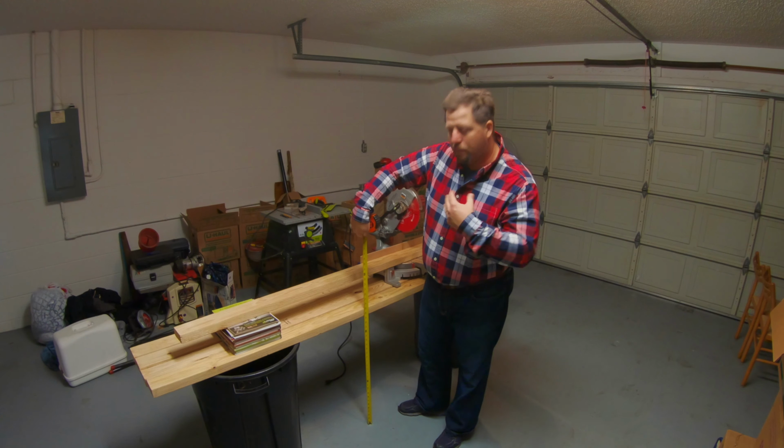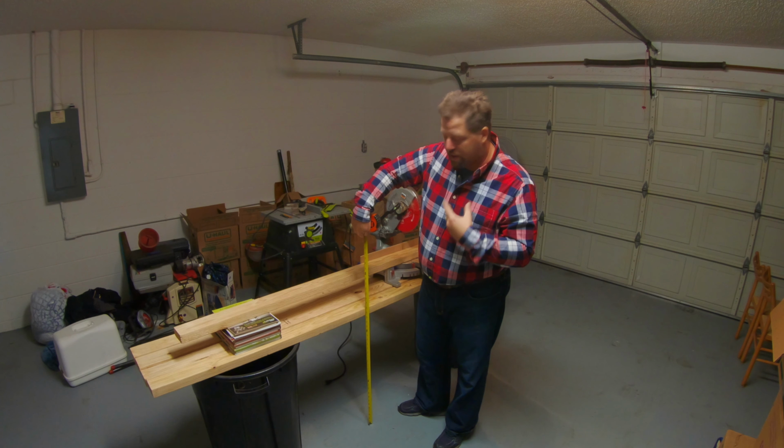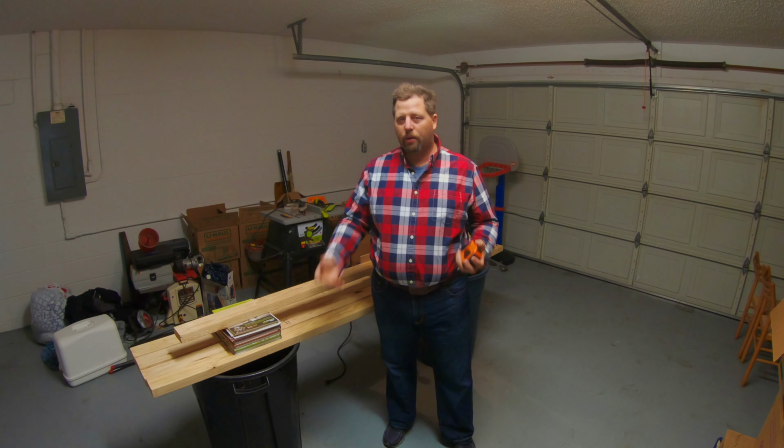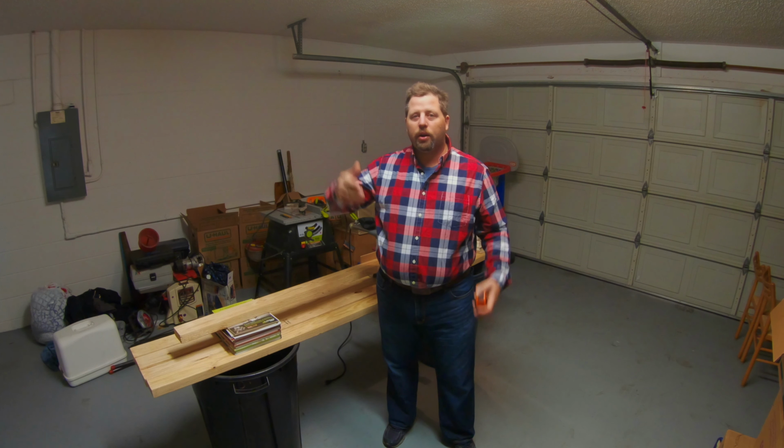If you use a lot of power tools or you do carving, then your bench wants to be a little bit higher to bring the work closer to your eye level, so you don't have to bend over quite as much. But start here. It's only sawhorses. We can always make more at a different height, so this is a good point to play around with the height and see what feels the most comfortable for you. For me, the proper height is 29 inches. Now, obviously, this is going to depend on how long your arms are, how tall you are.